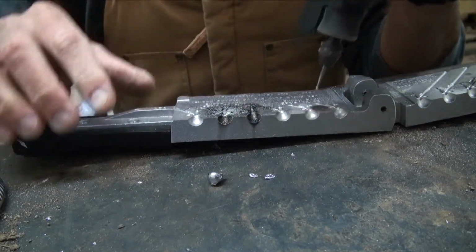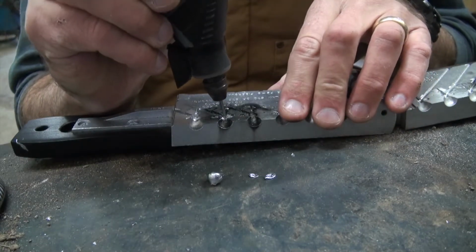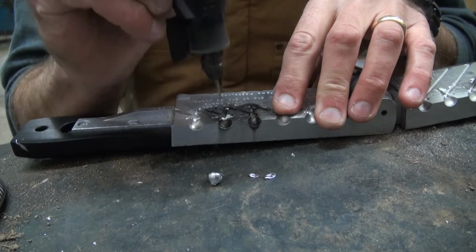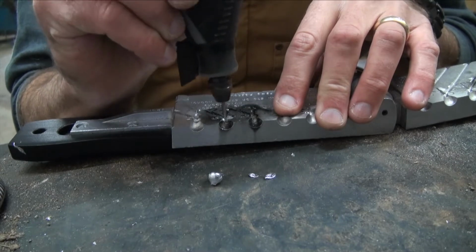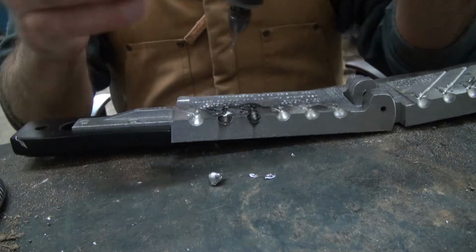These brush strokes starting at the tip or the wings of the football head and grinding up the side. Just gentle pressure, again, almost like brush strokes that really help smooth out those would-be undercuts. That's what makes it release cleanly.